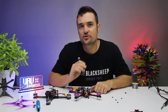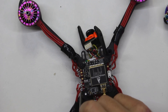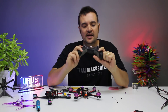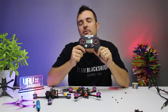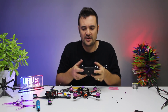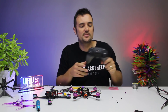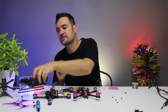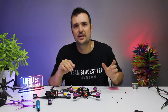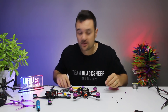So this one is going to be super easy. You can see just here on the side - hopefully my big head's not getting in the way - we've got 5V, ground, and S-Bus. The reason we're using S-Bus is because that's what we're going to be using. The radio we're using today is the X-Lite - I'm going to link this down below. This is my radio of choice. It's relatively cheap, super easy, and FrSky has a very strong radio link. We're going to be setting up using the X-Lite, though it could also be the QX7 or pretty much any FrSky system.